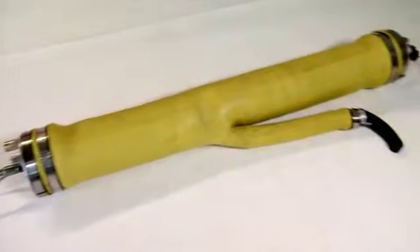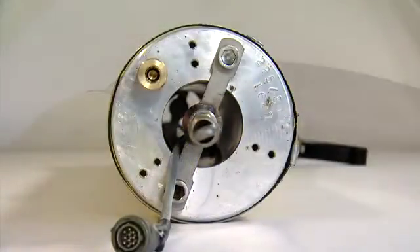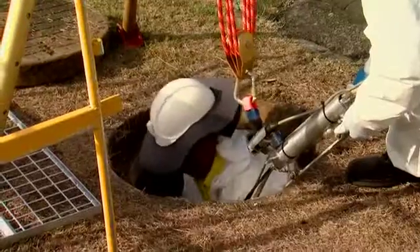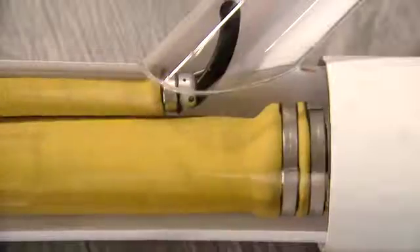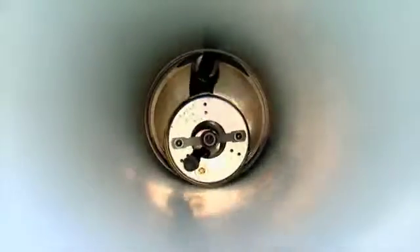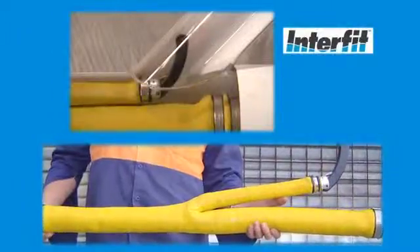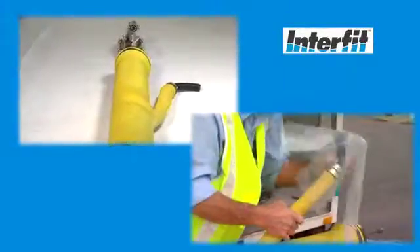The patented Interfit Packer is simple and elegant in its design and has been engineered to take maximum advantage of the resin and sock. The Packer is free of moving parts and electrics. It is lightweight yet robust. The Packer is pushed along the main pipe; when at the junction, it is rotated into place and then launched up the lateral. After the resin is cured, it is removed from the junction and taken back to the manhole. The one design of Packer is capable of being used in 90-degree T or 45-degree Y configurations. The Packer has flow-throughs, so is capable of operating in live flows.